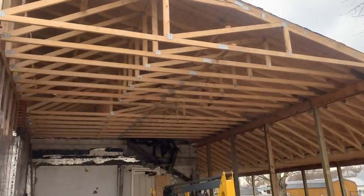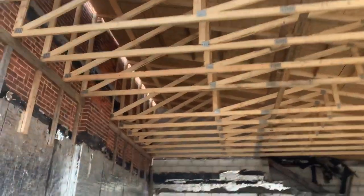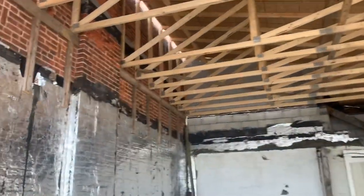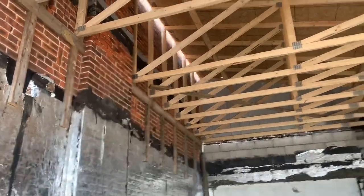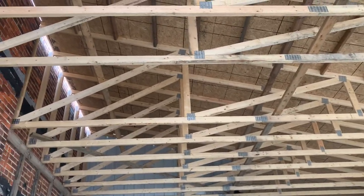This is an interesting concept. This is actually a builder that built for us back in the 80s, and he really liked the concept of those inverted trusses — thought it was a little bit stronger. And then running planks, like a 2x10 over there. Check this out: two foot on center mono trusses.